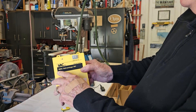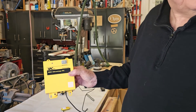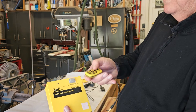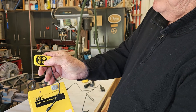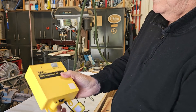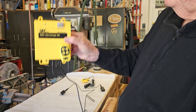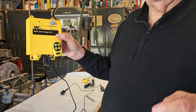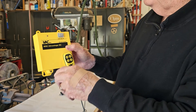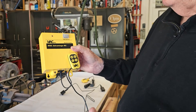This is the unit right here — it's the IVAC MSC Advantage RC. This unit controls the IVAC switches, and to control your Oneida Supercell, normally you have a little remote, but this acts as a remote. I can turn it on, I can turn it off. This hooks into the bottom of this unit, and it has Velcro on here so you can just Velcro it, hang it up, plug it in, and now you've got a bridge to the Oneida Supercell. This remote controls the Supercell — the units for each of your tools goes through here and then goes over to your switch. That's how you solve the problem of the magnetic switch on the Supercell.